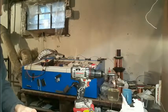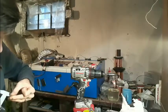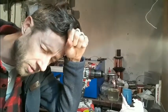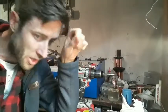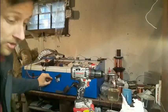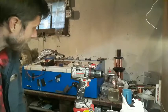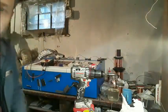On modern guitars, typical neck spacing is 50 millimeter, which is 1.9685. So approximately 1 and 15/16, which is 1.9375. That's for the string spacing, and it would be preferable to have the magnet a little bit wider than that. But I want a similar magnet.